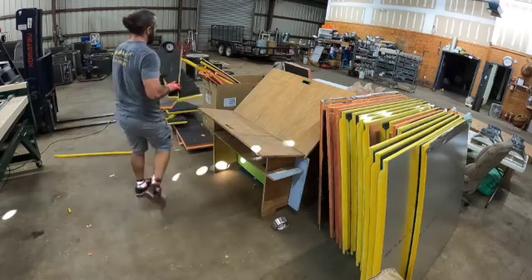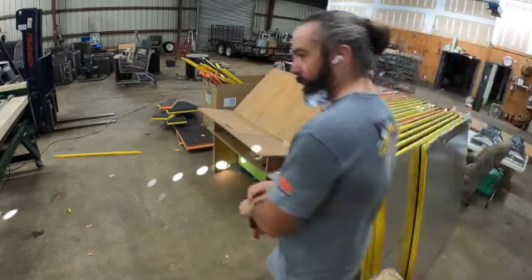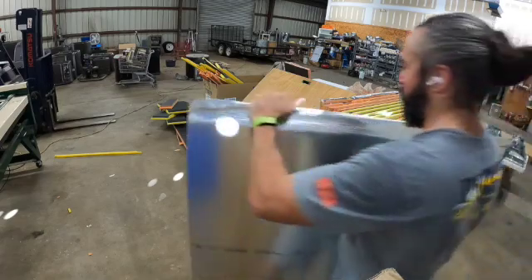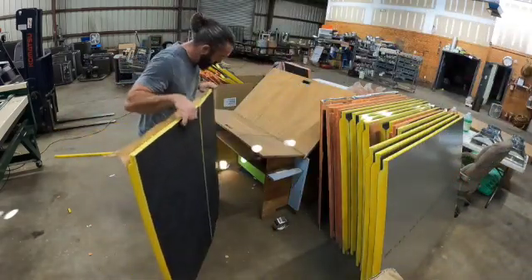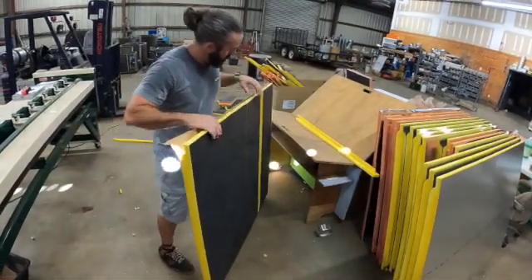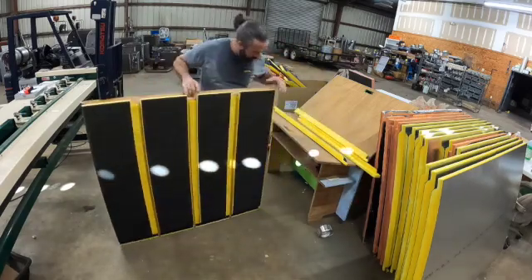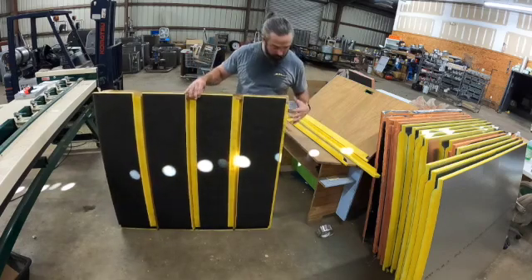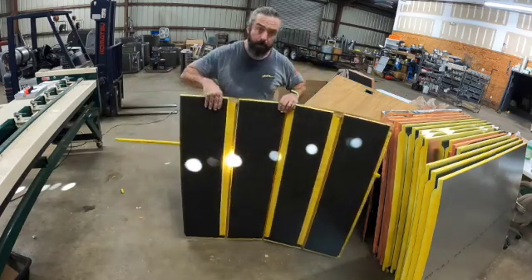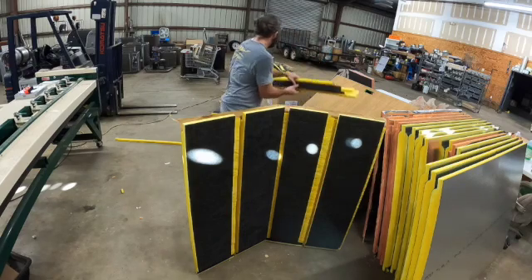We've cut all of the board we need for the upstairs. I'm going to go over what we do now as far as fabrication. You've got to take these pieces out that have been cut out. That's what the tools in the duct board machine do. This is the A tool cut — it cuts what I would call part of a shiplap. This is the B tool cut, the C tool cut, the D tool cut, and the E cut. The E cut just cuts it all flush. That's garbage — and this is a fabrication table.